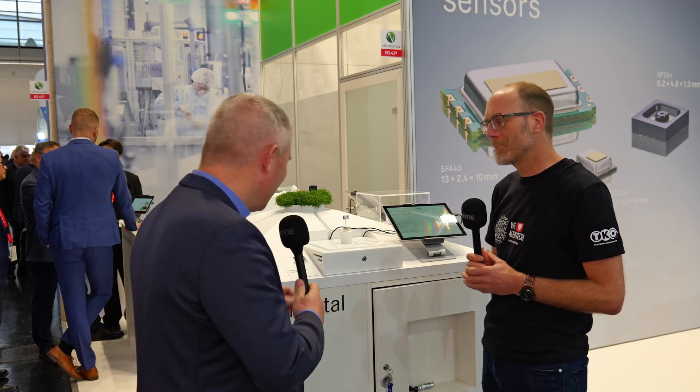Stefan, you're able to introduce something that's really unusual, maybe unique in the market here — a way of doing carbon dioxide, CO2 sensing that is newly implemented in chip form. So if you look here, we have our well-known SCD40, which is a sensor based on photoacoustic. That's the larger device, already a couple of years in the market. It's normally used everywhere where you want to measure CO2 in a home environment — building automation, indoor air quality measurement, all this kind of application.